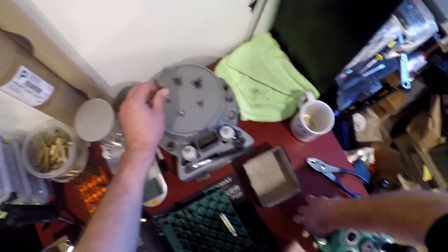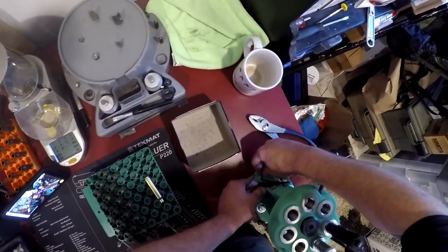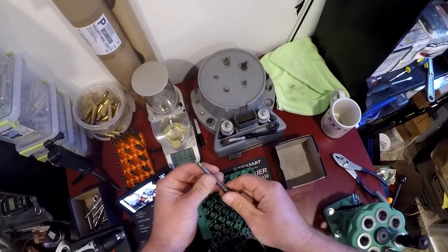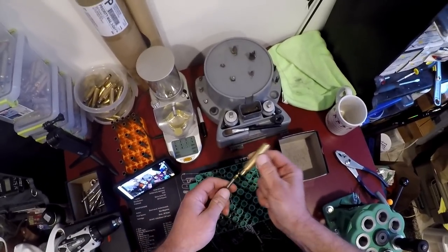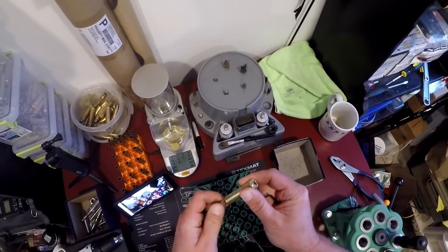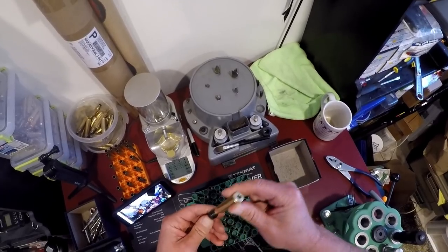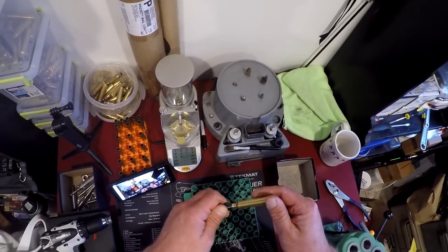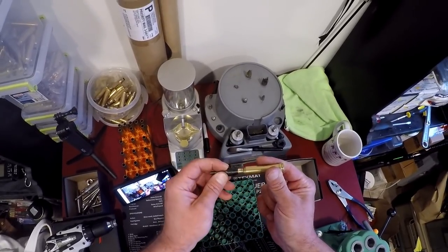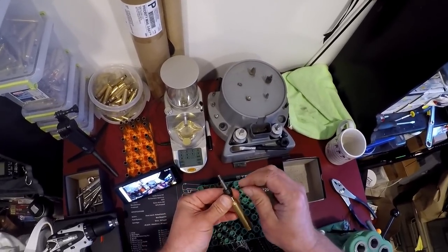so I need to get this guy fixed. I got all my Allen wrenches around here. So basically we're going to loosen that to where it kind of goes up and down. I'm going to throw our brass in here. I'm going to feed that little trimmer up through the flash hole like that. And then we're going to tighten down. Once it's up there, we're going to squeeze these together. And that's where we're going to trim it, tighten it down to.